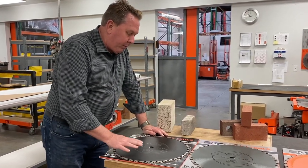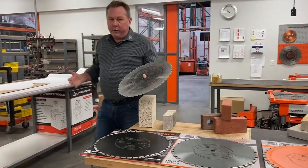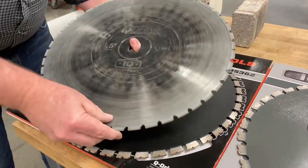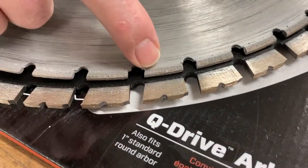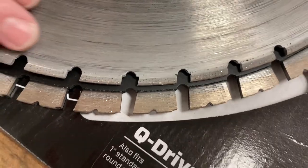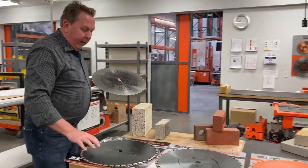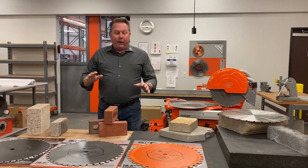One of the things I can show you about this blade — and really all blades — is what you can expect and what you should be seeing with a blade if it's the right blade for the material. Here is one of the combo blades. You can compare the segments that are left here from new. This blade still has a little bit of life left to it, but it's almost done. This is what I would say is a successful blade that has been cutting the right material, because it's wearing well and you're getting your value out of this blade. That's what you really should expect — that type of wear for any blades that you're using.